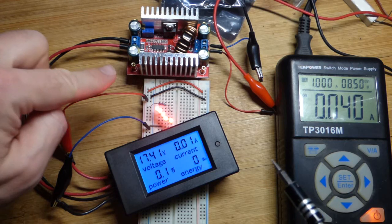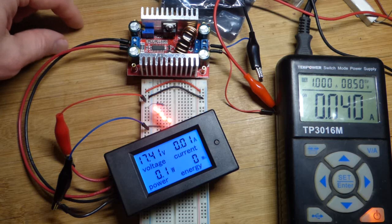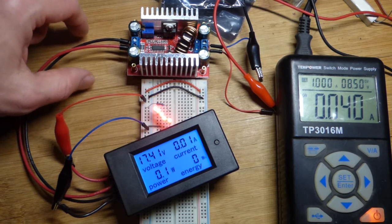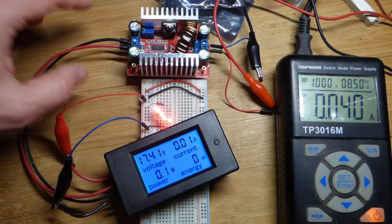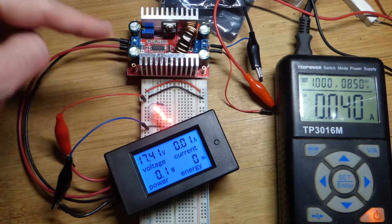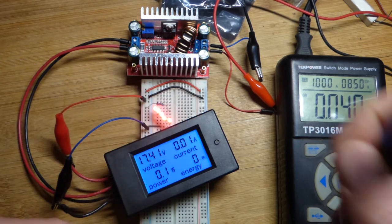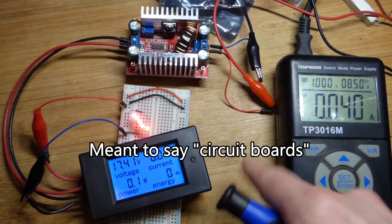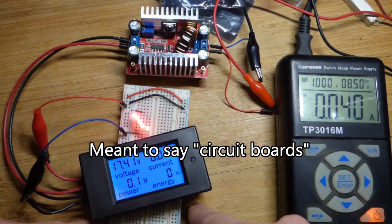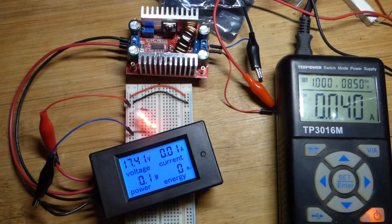That's most of my warnings. I'm not setting this down on my bamboo surface — it kind of looks like wood — because there are exposed pins at the bottom. That may have been how I fried the first one. So I'm using these little standoffs — you see them a lot with integrated circuits — so the bottom of the board is not touching the surface.